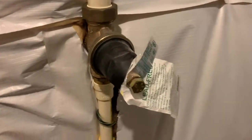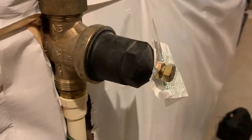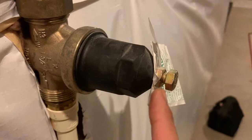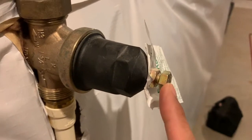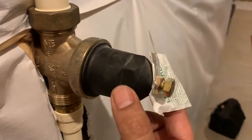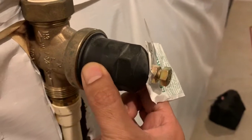I am going to isolate all the valves and then open it. Opening it is very simple. After turning off the water supply, all I need to do is loosen this check nut and then loosen this bolt till there is no tension on it, and then I can remove this bell housing and then the mechanism — the spring mechanism is inside with the strainer and everything. So let's see.